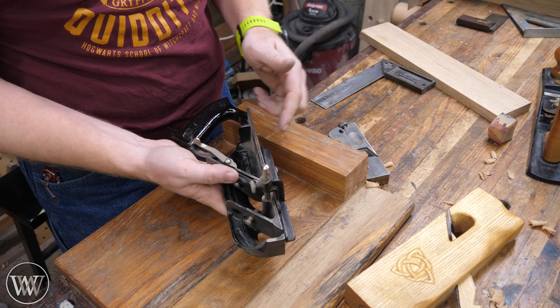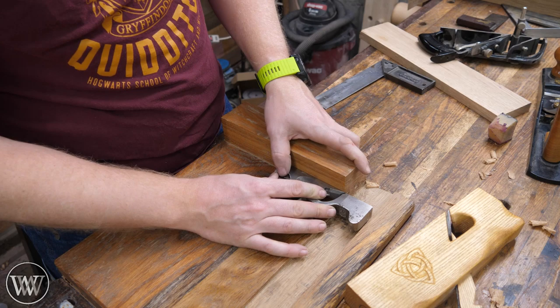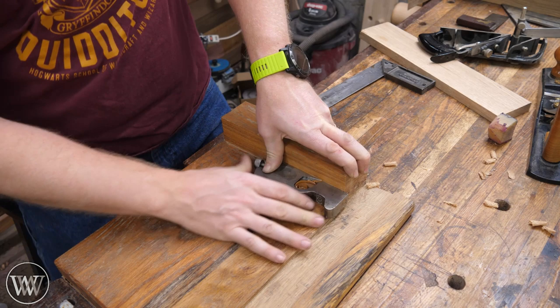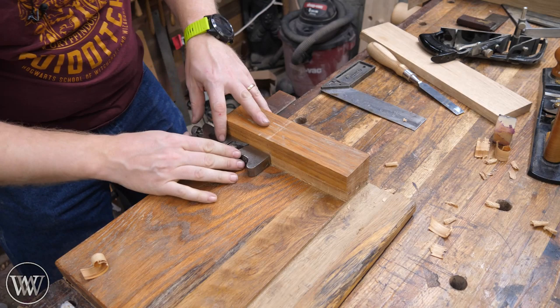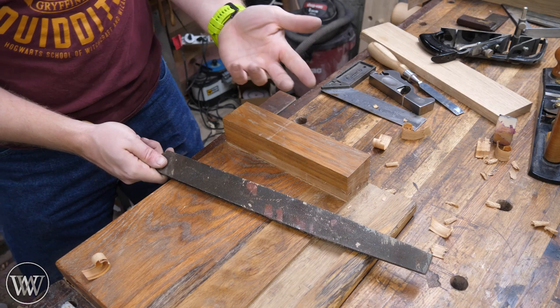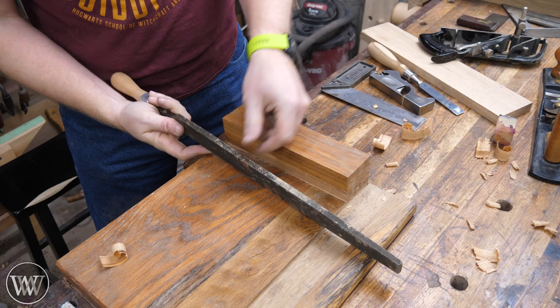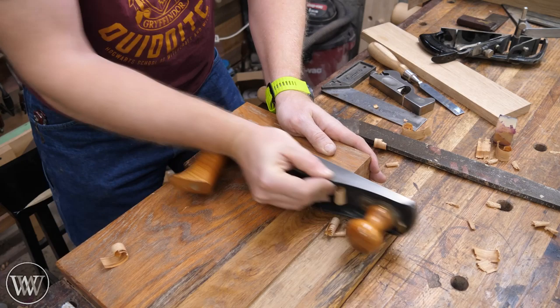The problem with this is it's not going to come all the way up this edge, but that's really not that much of a problem. I'm going to start taking off material here and I'll show you why in a moment. I'm going to start right up here at the front edge, take off a shaving, back up, take off another shaving from here out, then back up a little bit farther. Then we can back up a little bit farther and take another shaving end to end. We'll just keep backing up until we get a shaving from one end all the way to the other. Alternatively, if we had a big file, we could use that to come in here and cut this edge — get this clean edge right along there.